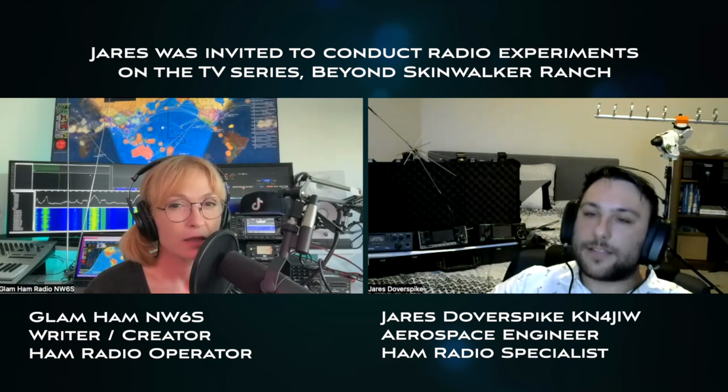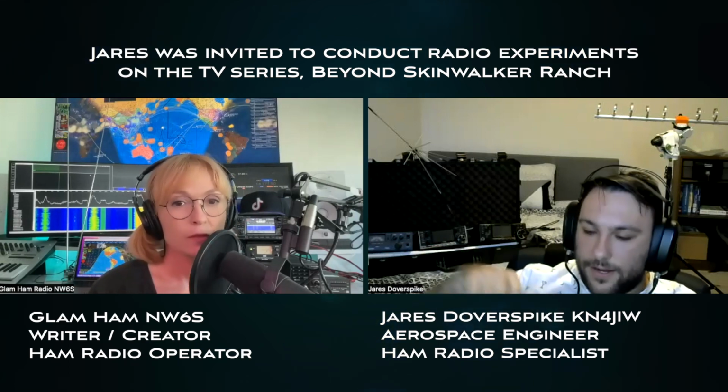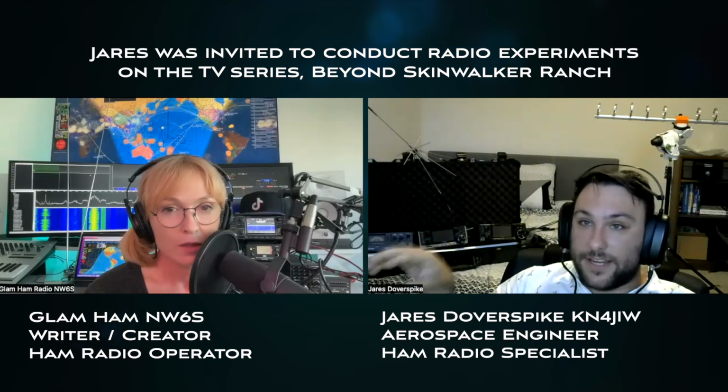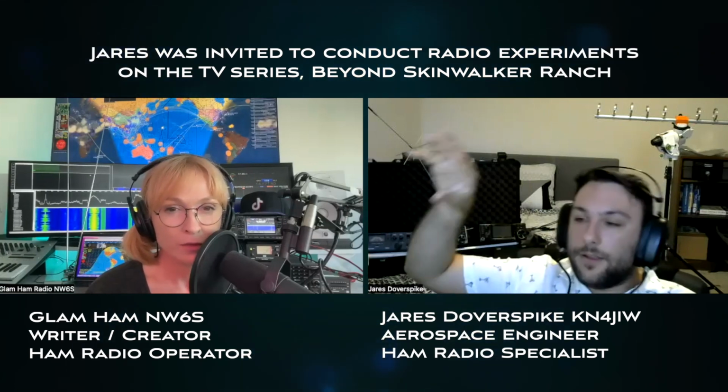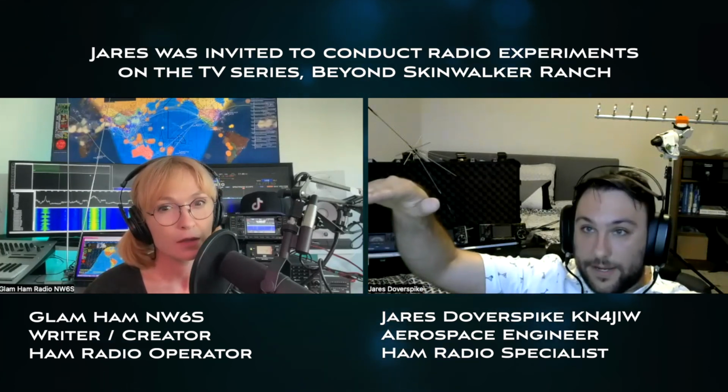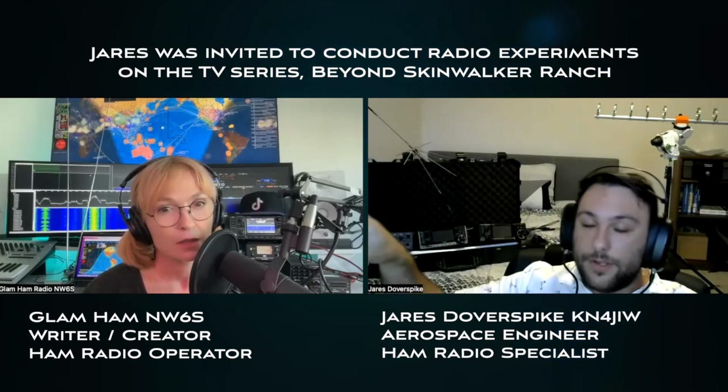Of course, you're going to have less and less power being sent on each additional signal, depending on the cleanliness of your radio and all the different stuff you're doing. In the other direction, at 1.6 gigahertz, your first harmonic down is 800 megahertz. Your fourth harmonic is going to be in the 400 megahertz range. That's why I wanted to do the 400 megahertz range to get roughly to 1.6 gigahertz, because the more times you have to multiply or divide, the more the power drops off. That's why we're looking at not just the 1/11th harmonic at 154, but also bumping it up to 400-some megahertz, where you would get into the fourth harmonic.